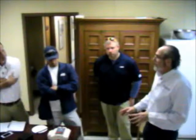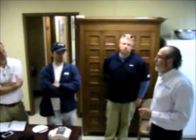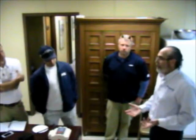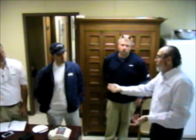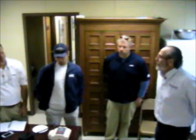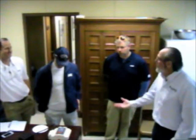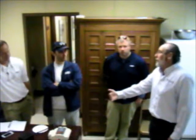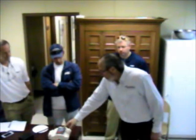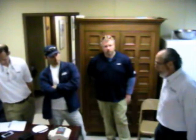Do you remember the old 4x160 — just four buttons and everything on it? I think I have one of those. Start and stop switch, and then the four buttons. Those haven't been out for at least five or six years now. People used to ask me how to set that up because you have no idea. Those did require a time clock. I always told people: choose your four speeds with a clean filter — 5, 10, 15, and 20 pounds. I always thought that worked pretty well. At 20 pounds, you don't really want a filter running over that anyway. Hopefully your pressure gauge works. I always told people to set them up that way — it gives you a good reference point three weeks from now: 'I know I set speed three up at 15 pounds, but now it's 18.' So that gives you a reference point that way as well.